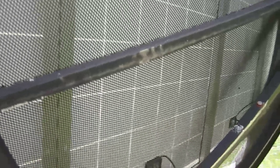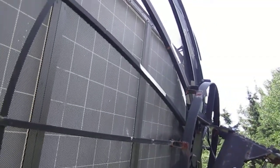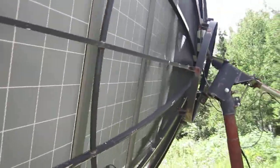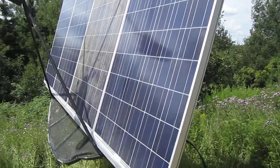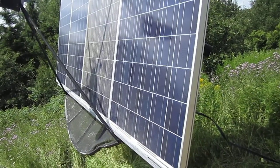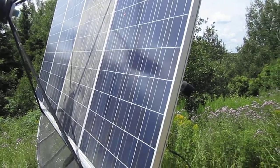It's a real simple setup, very cost-effective. If someone has one of these dishes in their backyard and it's no longer in use, turn it into a solar panel holder. It's not up quite high enough in the sunshine — I need to lift it up another foot to a foot and a half so the bottom edge clears properly. Thank you for watching and good luck with your solar installs — subscribe if you have not, and thank you very much to those that have.